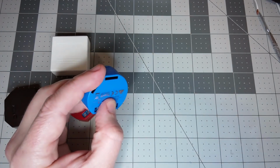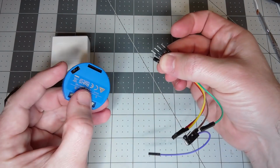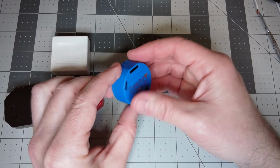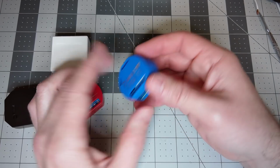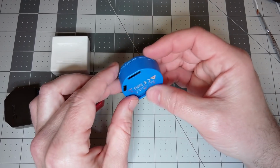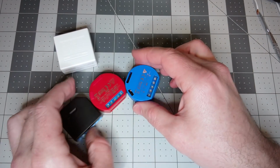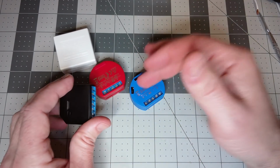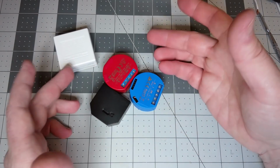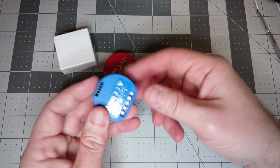And you can take and put in your DuPont jumper wires and you just put them in here and you could flash the ESP. Now, the stock firmware comes with MQTT and an open API. But of course, I did a video, we'll leave the link in the description, of how to flash these with just a web browser. You don't need to do any soldering or even mess with any little pins. You could actually flash them in the wall, what people have done. It's pretty cool. I do like the Shelly switches, and being able to leave those switches on the wall is pretty cool.